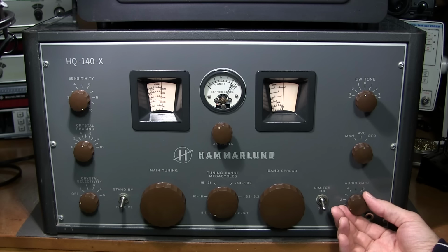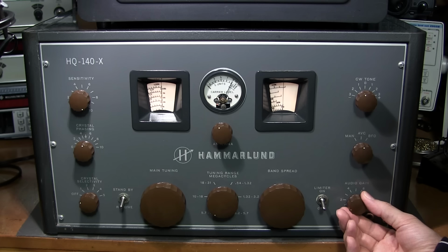So right there is another time signal. It's the 10 megahertz time signal. But my standard in here is mixing in with it a little bit. So my frequency standard is at 10 megahertz. You won't hear the difference between the two frequencies because they're extremely close. If there was a difference in the frequencies, you'd hear a tone. There is no tone there, aside from the tone that the WWV had going there.